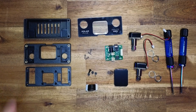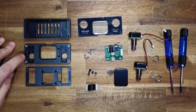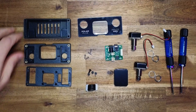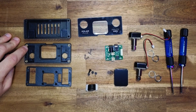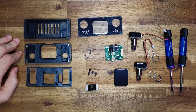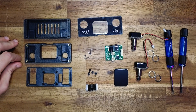To build your Polar Plus you'll need the 3D printed enclosure. It's a three-piece enclosure, same as the Polar Mini, with a top, a middle plate, and a bottom part. I've already put the heat set inserts in here — they are 4mm tall M3 threaded heat set inserts, and we've got the exact dimensions you'll need for the enclosure design linked in our GitHub repo for the build.